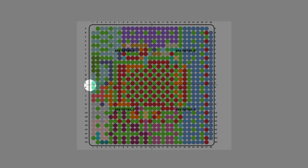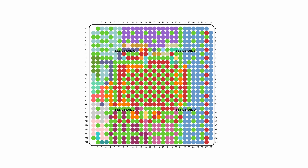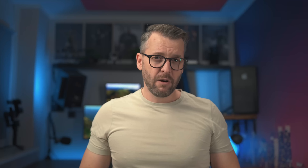The pink and dark pink balls represent two separate blocks of what is called SerDes. Without going too much into detail, SerDes converts into either an array of Ethernet ports, PCIe lanes, or a SATA bus. What's left are specialized balls for SD card support — the steel-colored ones on the center left — JTAG, the light olive ones towards the top, and USB balls on the top left. Each of these components will get a dedicated, more in-depth video when we get to picking parts and routing them on the actual PCB.